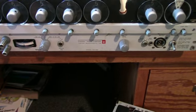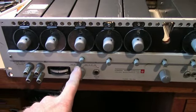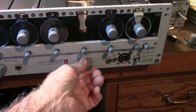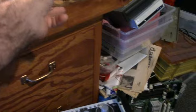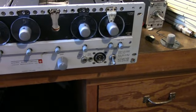It has a monitor switch here where you can measure the output voltage. This will have an output of 0 to 2 volts, which is continuously adjustable. It has GR874 connectors — I don't like these connectors, so I modify them for BNC or N, whichever. Output is 50 ohms and it's leveled.